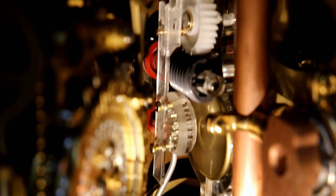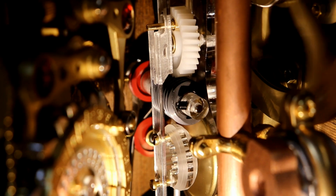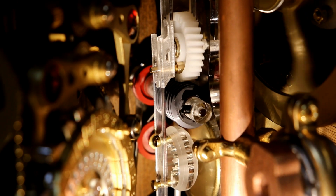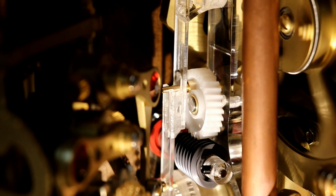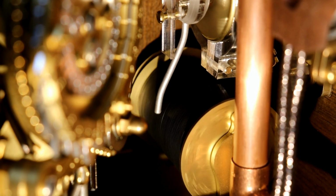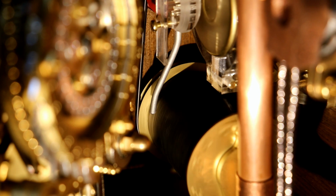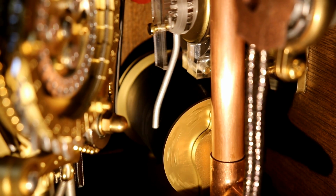I see. So the spring also goes round a worm drive. Because it's a spring, it seems to jerkily pull it, which is absolutely fine. That in turn turns that gear. That's got the crank on it, and that is swinging this lever backwards and forwards, at the end of which is situated what looks like a stylus. That's not very good English, is it? At the end of which is situated a bent metal piece that looks a bit like a stylus.